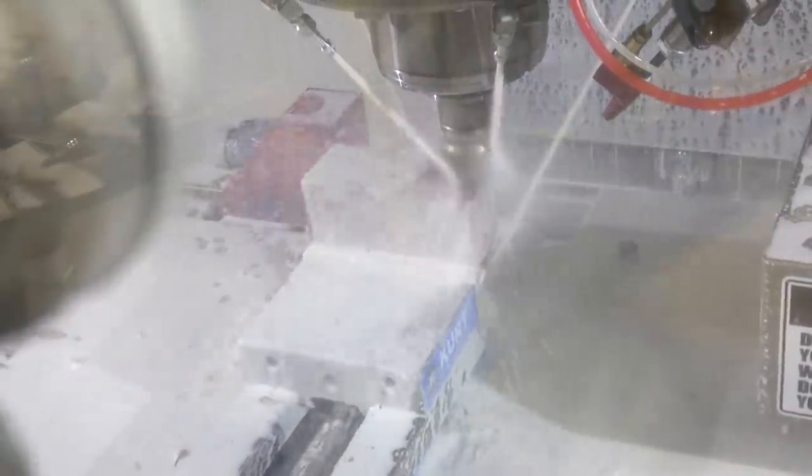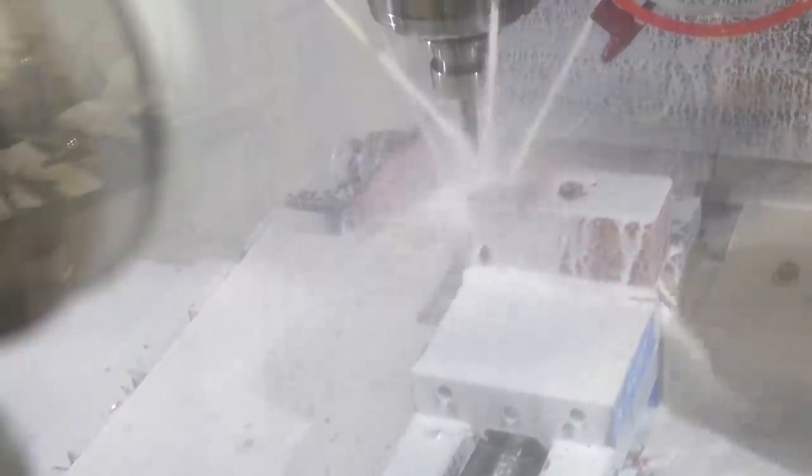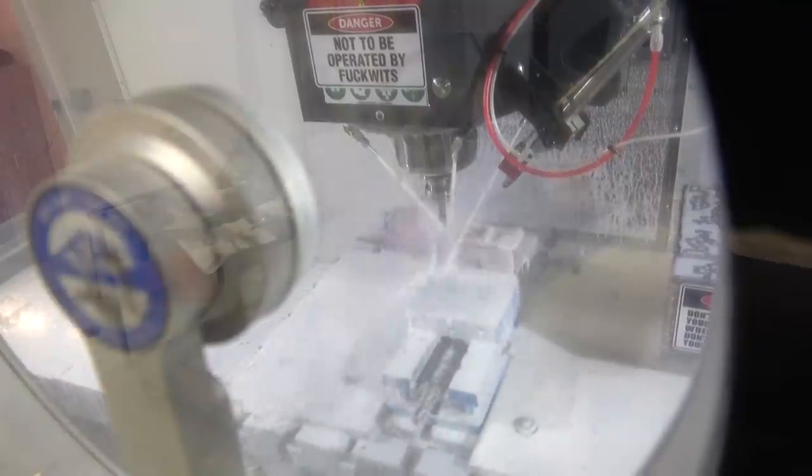Put her in a hundred percent rapids. We're just going to face mill this off with a two-inch face mill — inserts for aluminum. Just buck down the feed rate to 70 percent. Now we're going to helical that tapered bore. I just changed the feed rate a little bit here. I added in the M138 which is spindle speed variation — it's varying by 555 RPM per 1.5 seconds — and that's to effectively reduce chatter by not allowing the tool to set up a harmonic.